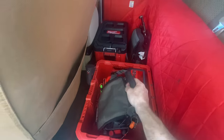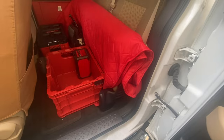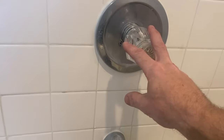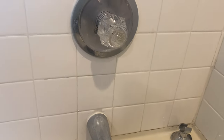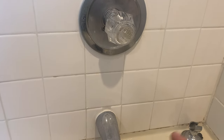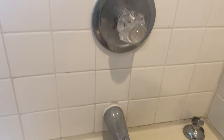I only have my TPLC with me today — my MCT is in my office. I shouldn't need it; I can get pretty much everything done with this. All right guys, you can see there's a pretty steady drip — something is not sealing off the water when it's in the shut-off position. It's an old Delta, single valve. The water was shut off to this area recently for some plumbing work. There are a lot of old galvanized lines, and when you turn your water off and back on, stuff can break loose in the piping and get stuck, keeping it from closing.